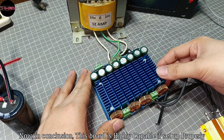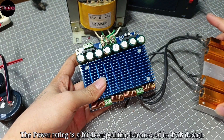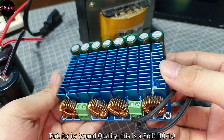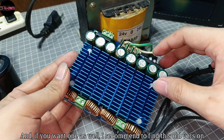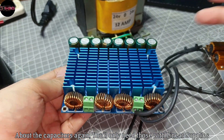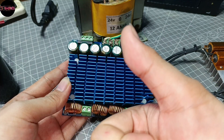In conclusion, this board is highly capable if set up properly. The efficiency isn't great compared to other chips, but its sound quality might be the best for a hi-fi Class-D setup. The power rating is a bit disappointing due to PCB design, and at around 35 USD it's more expensive than the ZK3002. Without modifications, I'd give it 6.5 out of 10 for power, but a solid 10 out of 10 for sound quality. I recommend finding this old version since the new version has an even worse output filter design. Capacitors are only needed with linear supplies. I just found an amp for mid-highs in my upcoming 2.1 amplifier project — feel free to ask questions in the comments below.